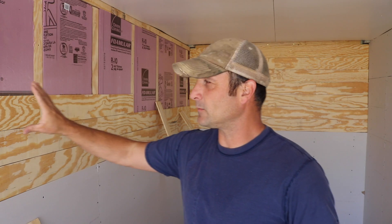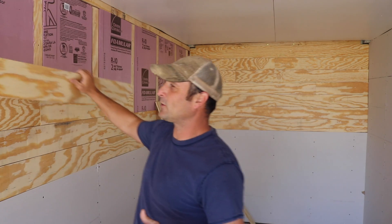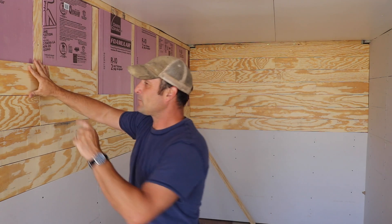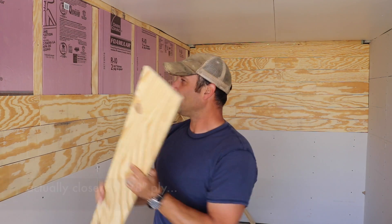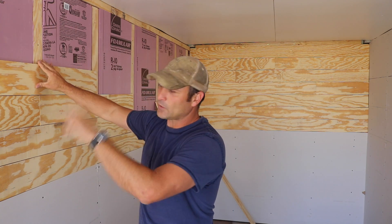Right now the walls inside here are about 80% finished. I've done most of it with drywall but now I'm just finishing it up with some ripped sheets of plywood stacked in a shiplap fashion. Anybody who's seen Fixer Upper with Chip and Joanna Gaines will know what this looks like. They use real three-quarter inch or one-inch thick boards, but I'm just using some cheaper quarter-inch plywood that I ripped into seven-inch widths, stacking them like this, and I'll probably paint them white and then trim them all out.